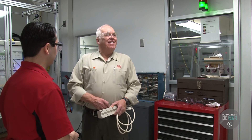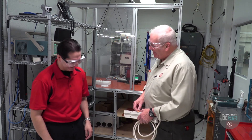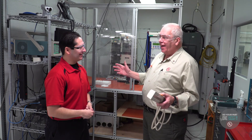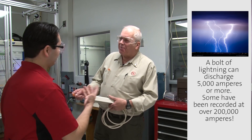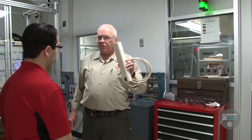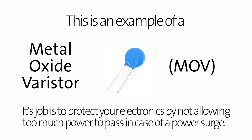I've been here quite a while. When the Lord said, 'Let there be light,' who do you think did the investigation? When Ben Franklin and I were inventing the lightning rod and running a kite up with a key, we figured out that cloud-to-cloud lightning strikes could put a big impulse on the power lines and give you a problem with your computer or your Xbox. And you have your power strips that usually help protect from those power surges. The little device inside is called an MOV, or a metal oxide varistor, which gives you protection to keep the insulation system in good, safe condition and prevent fires.